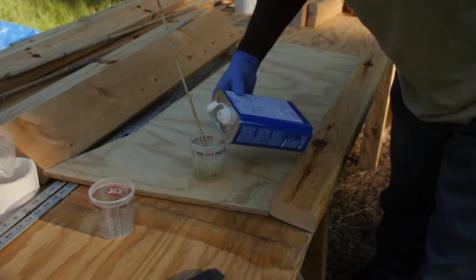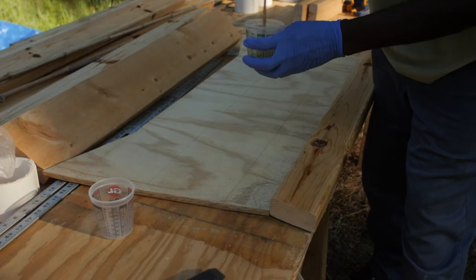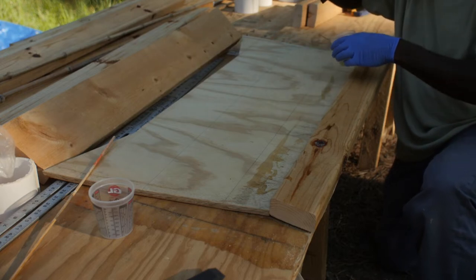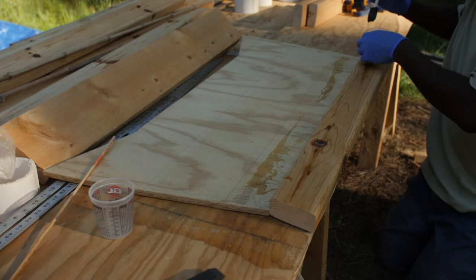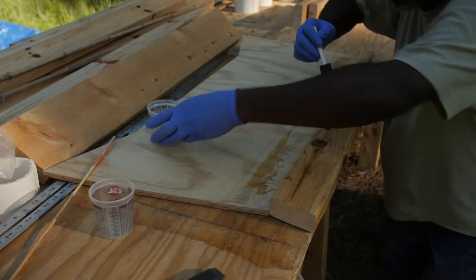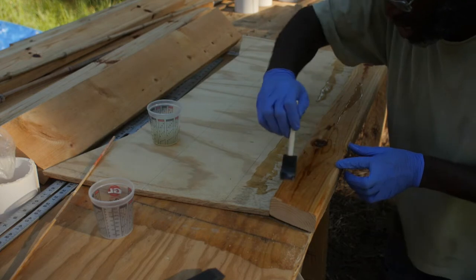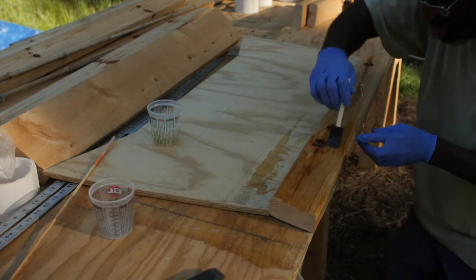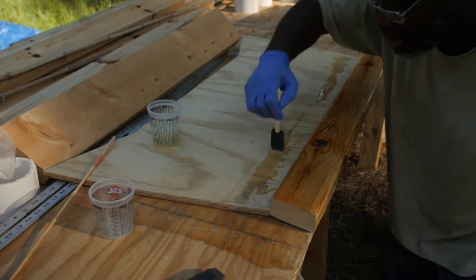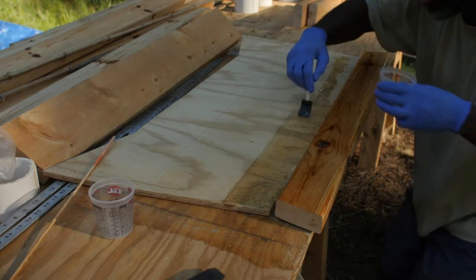As long as it's pouring like hot syrup, that's about the consistency I want for this first coating. You can either pour it on, drizzle it on like so, or just dab it on — whatever you want, doesn't really matter. Just get some on there and set it aside. Don't waste it because this stuff is expensive. We want more of it soaked into the wood so we don't end up with a dry joint.